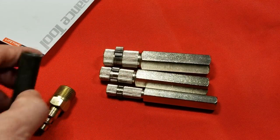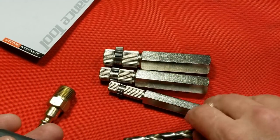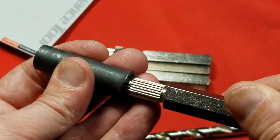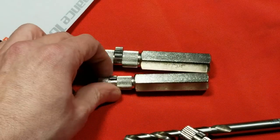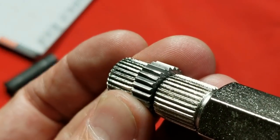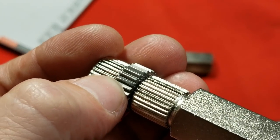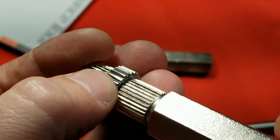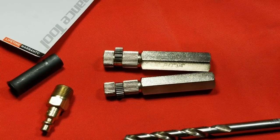And it really is unfortunate. With this little piece of tubing here, the drill bit goes all the way through — again it's 0.406, so larger than three-eighths — and no matter what you do with the extractor, you just can't get it to fit in there. They are made a bit cheaply too; you can see where during manufacturing that tooth got dented, and that can be an issue. It isn't in the area of highest bite, but that would make it slip and become less than useful.